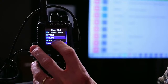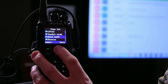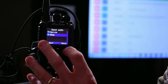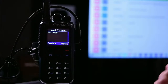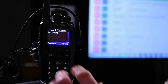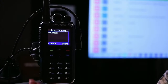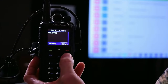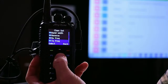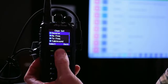If I go to RTCD it'll set both transmit and receive PL tone. Then I check my bandwidth - we're at wideband because it's a two-meter amateur repeater. I set my TX frequency - it defaulted to the receive frequency, but my uplink is 146.19, so I delete this and type in 14619, then press pound to add the zeros. TX frequency is set. I press P2 to back out. I could build this channel into a zone, but I just want to quickly get on the air and see if I can hear the repeater.